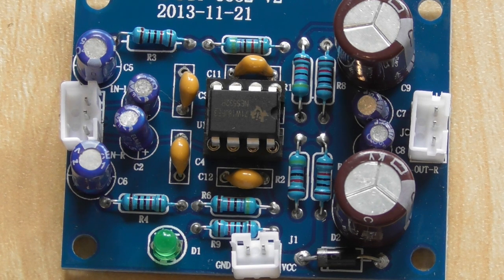Now you can increase the gain by changing resistor 5 and resistor 6 to 100k, and that will give you a gain of approximately 10. Now, if it's a gain issue, that will make the frequency response worse. But I know this chip very well. I mean, it's just flat up to hundreds of kilohertz naturally. So I've got to investigate why this is rolling off like this, because I just don't know at this stage.